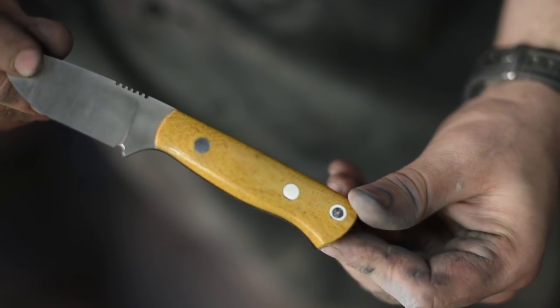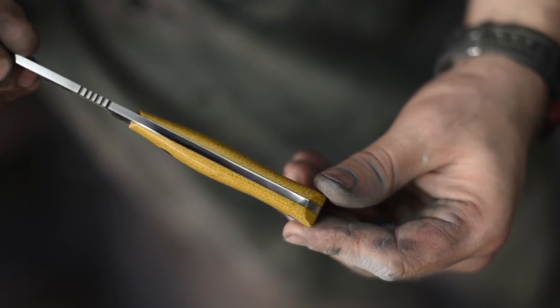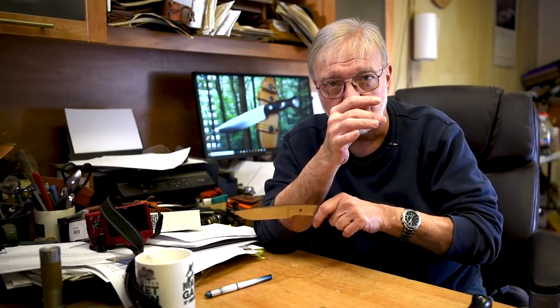That handle is now ready for polish. It's polished right there on the same line — at the end of that line you've got polishing wheels that bring up that nice Bark River shiny finish on the handles, whether they be micarta, wood, or whatever. Those wheels use the right compound, and there are different compounds for micarta than for wood. When we polish wood there's a specially formulated blue compound designed to polish wood. Once that's done they all go back on the same rack.